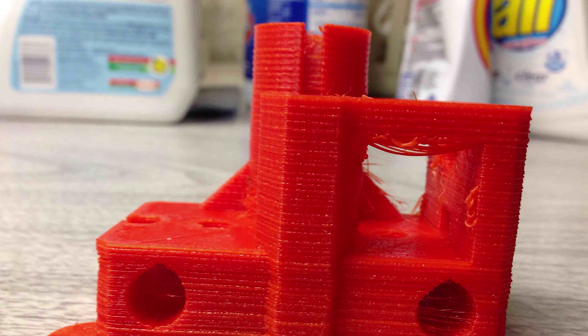And then there's sag, which is the opposite to warping — when a part cools too slowly and starts to droop down due to gravity, or otherwise looks fairly terrible. This can be a big problem with PLA when it's extruded at too high a temperature or the chamber is too hot. If you're having that trouble, just cool it quicker.